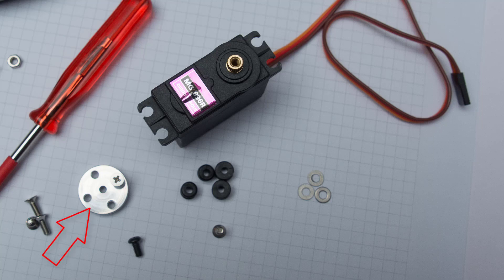You have to hunt carefully for the flat plates that go into the servo in the pack. When I found them they were really good, but I did change the screws used to attach the round plates to the arm structure. The ones on the left-hand side with a flat surface are slightly shorter and they didn't foul the servo itself, so I used those on all the servos. I also used some round washers in the pincer arm just to make things line up better.